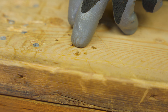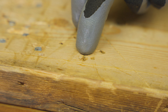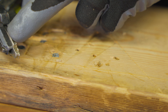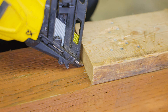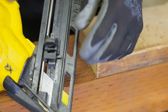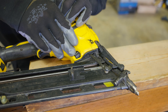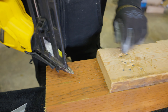You can kind of see the difference in the depth of these two nails — this one was a little shallower, this one's a little deeper. When you're running soffiting, you can't run it at full depth because of the angle you're shooting at — it won't allow the gun to activate. If you're running on an angle like this, you can't get the plunger to depress to get the gun to activate. You're going to have to change the depth setting so it will allow you to do that. So that's why these were dialed out a little bit when running finish nails on an angle — now you're dialed and you can run.